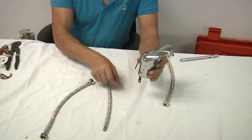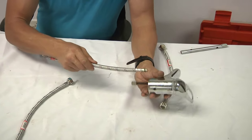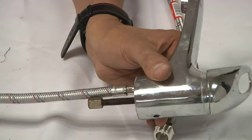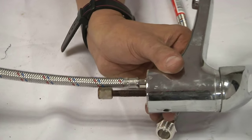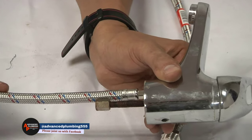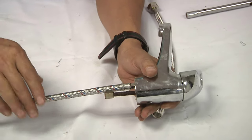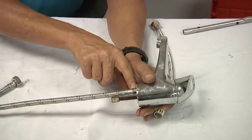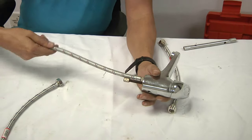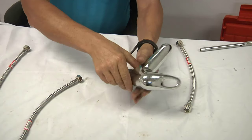the flexi connector springs a leak at the bottom, then you get a flexi connector like this at the hardware, depending on what size you have, and all you do is you screw it in there until you no longer see that black rubber. Basically, you don't have to tighten this at all with a shifting spanner or pliers or a spanner. You just tighten with your hand until it feels tight and you stop. That will prevent this from leaking over here, and your job will be repaired. So that's pretty easy to change. I'm going to show you exactly how to install it in the next video.